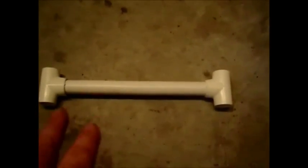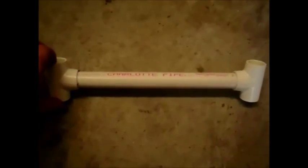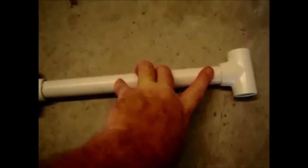Just a quick tip when you're putting these T-pieces in. You've got to make sure that they're perfectly aligned. You don't want them sort of skewed, because you want all this to be square. So what I suggest is when you put this on, put one end in first, doesn't matter how that goes, but when you come to put the second one in, do it on a flat surface, and then push the T in, and actually hold everything against the ground or against your flat surface, and then you'll make sure that everything's square then. When you come to put it in, everything will be lined up.